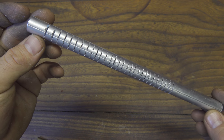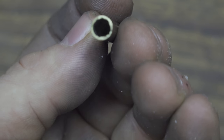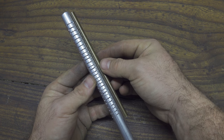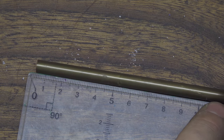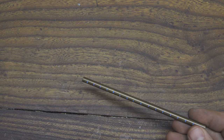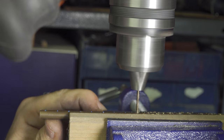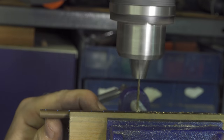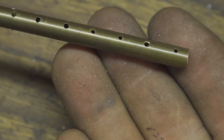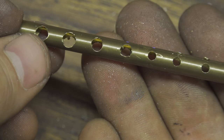I only need to put another tube inside this aluminum one. This is a smaller tube made of brass and is 6 millimeters wide. This component is very important because it helps cancel out the waves. With a marker I will mark a point every centimeter, and using the drill press I can drill holes through the brass tube. It's very important to start with small drill bits and go up — starting from a 1 mm hole and going up to a 4.5 mm wide hole.